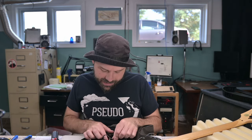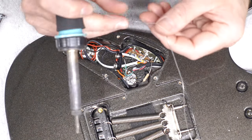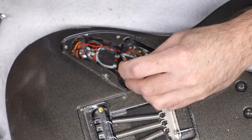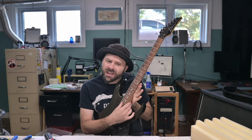My brain. And I know a Seymour Duncan definitely needs the impedance of the pot weighing it down, which is why I have a 470K resistor in here, simulating the pot in the position where I don't use volume on my bridge. Don't care for it. All right, the Billy Gates is in there. Billy Gates. Billy Goats Crunch. That's my tuning. So what's this like?